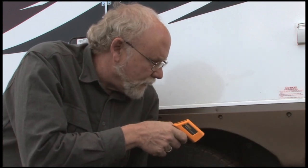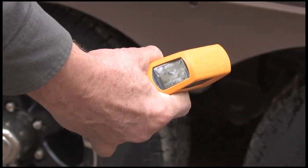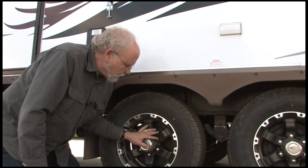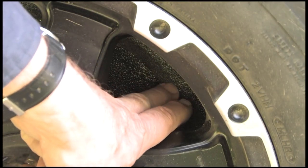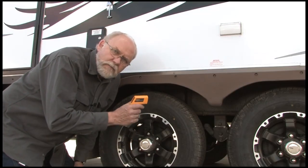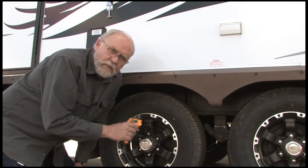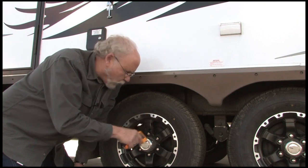For this part of the walk-around, a digital infrared thermometer comes in really handy. These are inexpensive — they can cost about $50 or less. This is a Fluke model 62; it costs about $80 and includes a digital readout of temperature with a laser pointer to show you exactly where you're measuring. You aim it at the surface you want to measure and instantly get a precise temperature readout. This particular style of wheel has a space between the spokes allowing direct access to the brake drums, so you can take a reading directly off the brake drum.